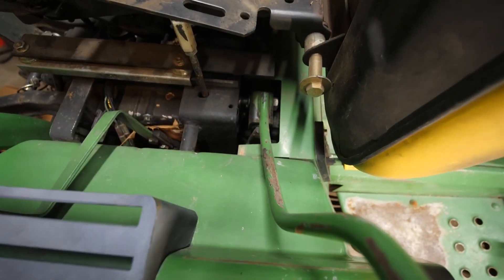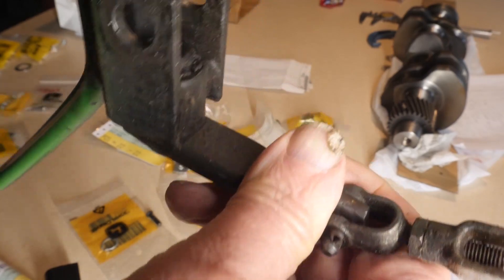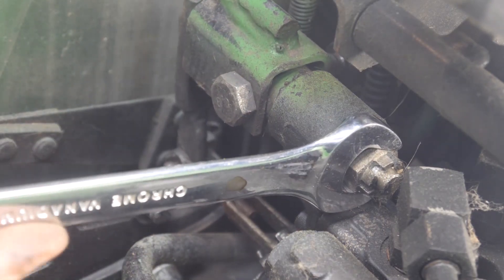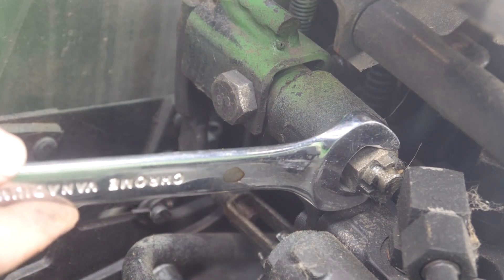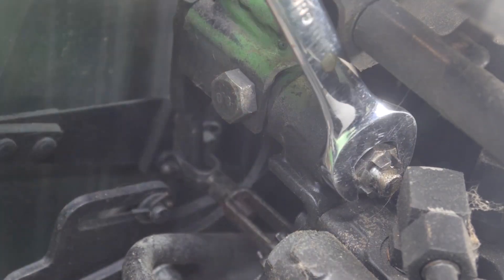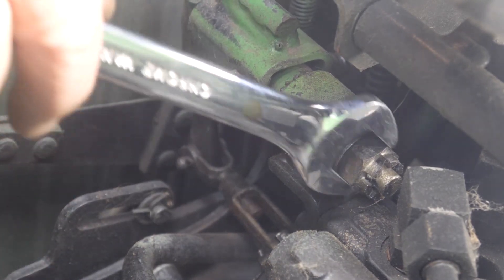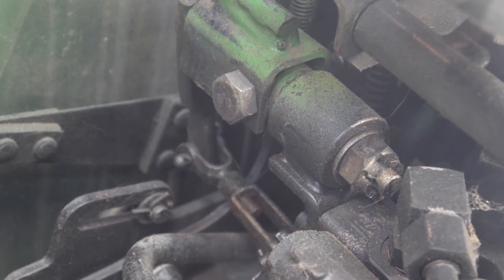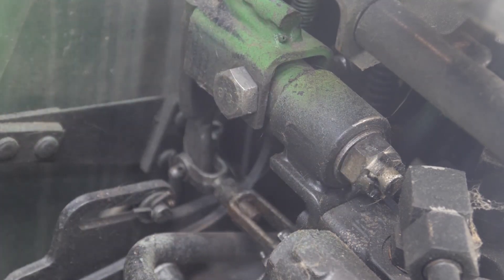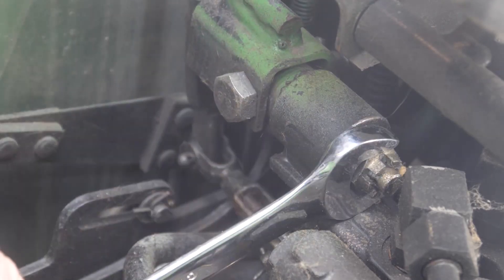The main lever and this second piece — also called a lever — has a pin that goes inside. It's held with a snap ring and gets a lot of use. The first thing you can try to tighten up this bolt is to remove the cotter key and see if you can tighten this castellated nut. This is only a temporary fix, as it checks lateral movement by binding the washers and support, but can't make up for worn bushings. That made a lot of difference, and that special bolt through there is $125-some-dollar.